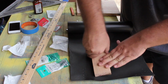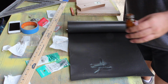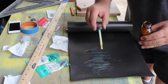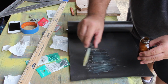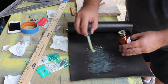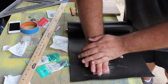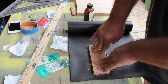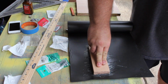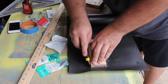With the drawer lining, I'm going to spread some of this adhesive on there as well, and glue a layer of it to this arm. I did that for a couple of reasons. You want a little bit of padding between that and where the camera sits on the arm. You also don't want your lens to hit the wood, just in case. So a good bit of padding there is always a good idea.